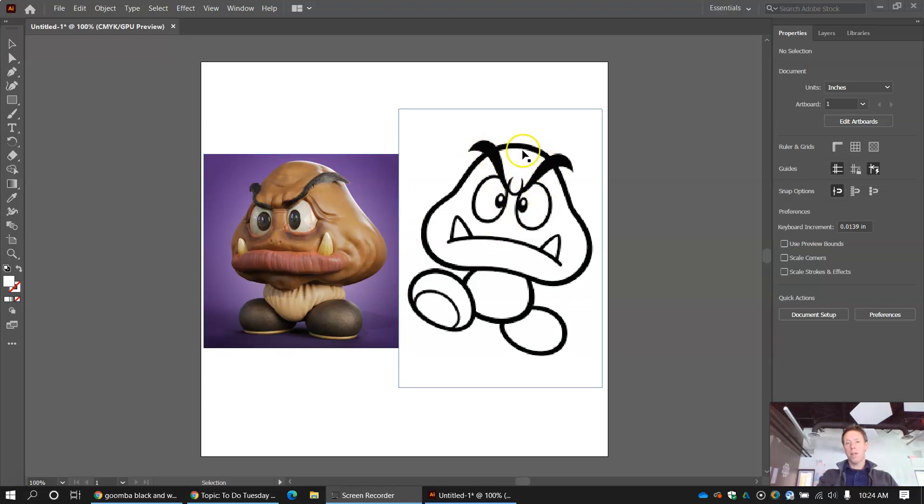So just keep that in mind. I recommend you don't laser etch a photograph or something that's really heavily shaded — it's just not going to turn out well. Versus if you do something that has a black outline, maybe two or three colors, black and white, or maybe a little bit of gray, that can sometimes look perfectly fine. This will definitely turn out and stand out because we have black against white, so it's going to etch at full depth. White does not get etched. If there's any kind of color, even slightly off-white, it will get etched.